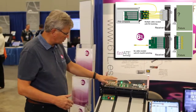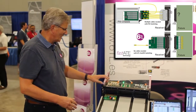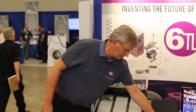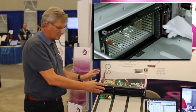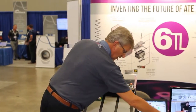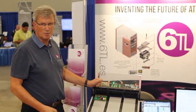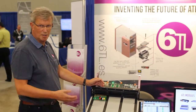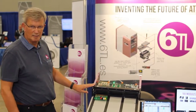We have a range of boards — different switch boards — that can be placed directly into the mass interconnect, eliminating the need for cables. The big advantage is that it makes the whole design of the test system a lot more simple. You lose a lot of the disadvantages of a cable, meaning your schematics will be much more simple. The cable length that can interrupt the quality of the signal is not there anymore, and the entire system becomes a very efficient and clean build-up.